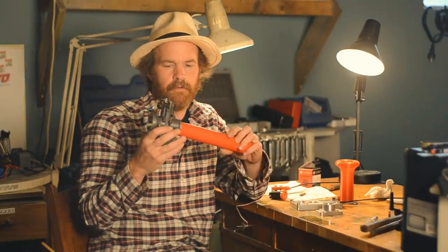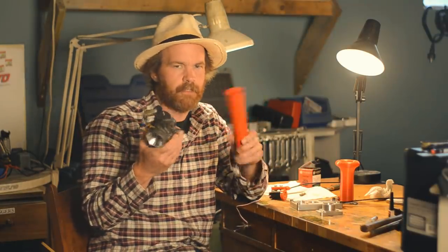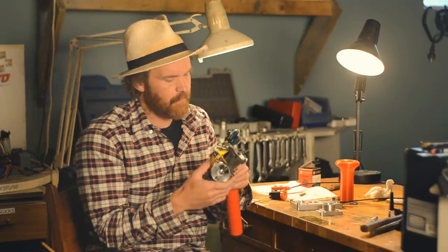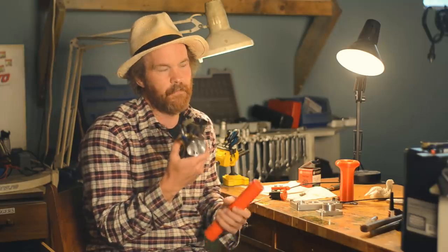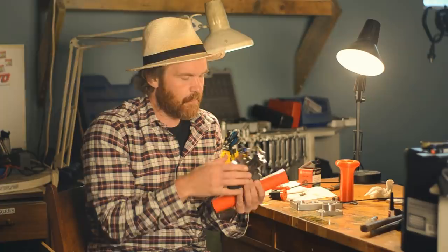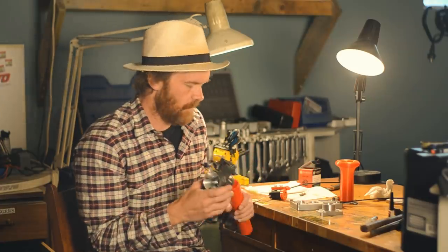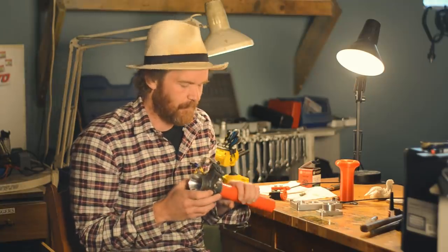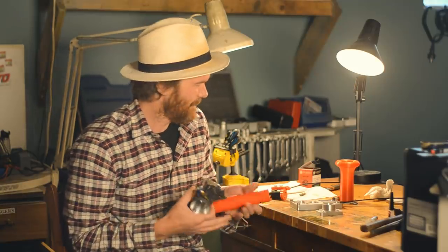to keep it under constant load, to best simulate the conditions it will be under when driving the variator in the bike. I can make an adapter and hook a normal carb up though, just for testing purposes. With the idle screw turned all the way out, so the slide is all the way down, I think it will create enough of a restriction so that it will start and idle on the primary carb, and then we can whack the secondary open just to see how it reacts. For fun, basically.